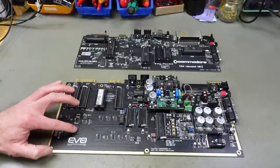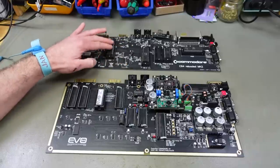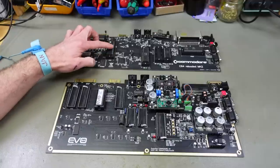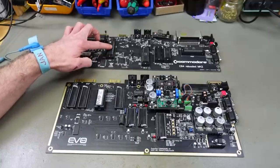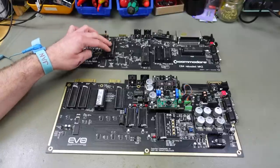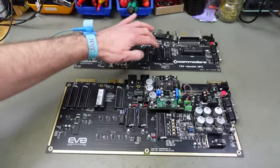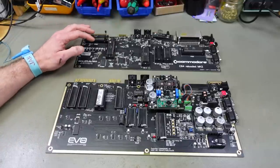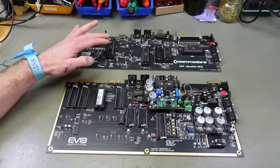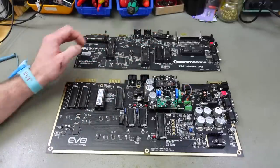This is pretty similar. They use the same RAM in here, basically. This has some other quirks. This is very plug and play, no jumper settings to set on the Mark II C64 Reloaded. So this is a bit smarter in a way. You can plug in chips and it's going to auto configure to the voltages the chips need and things like that, whereas you have to set some jumpers on this. This doesn't include the preamp stuff, obviously. It also has dual SID sockets.